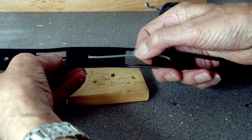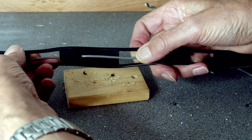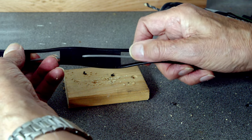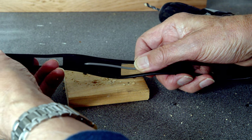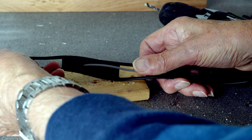It's essential you make sure this is tight because you want to preserve the spacing between the outer conductors of the ladder line and this inner section that you're threading through the centre, to create the fourth element of your antenna. So that will produce a four band antenna: 40, 20, 15, and one other band. The other band must be higher than the 20 metre band in order to accommodate it in the 450 ohm ladder line.